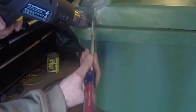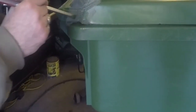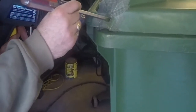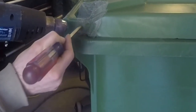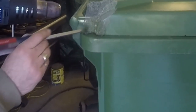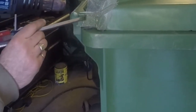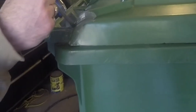After a while you get a bit of plastic — I'll just kind of smooth it through. When that part cools it'll hold the mesh in place and I can poke it into a crevice. If you're patient and take your time, you'll get it all into the area without getting it too hot. It's preferable not to get it too hot because the hotter it is, the longer it takes to cool, and you have to wait for that area to cool before you can move on somewhere else — otherwise it'll draw the mesh out.